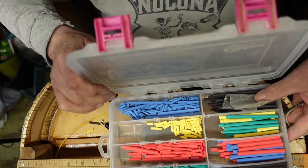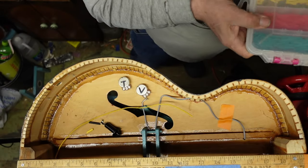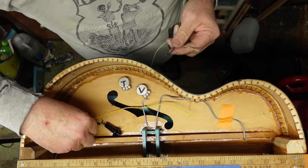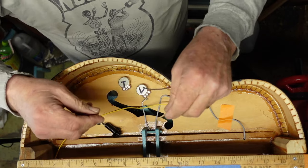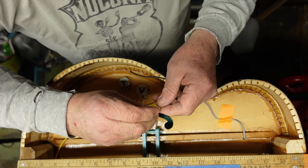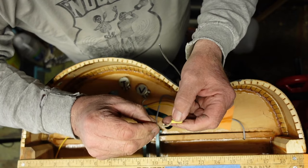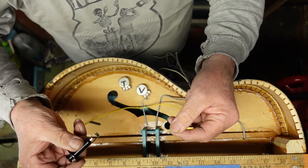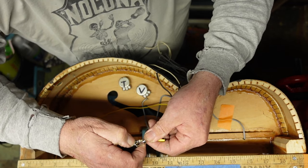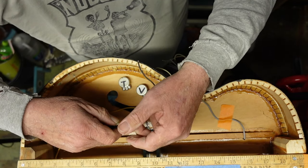So when I go, never leave that open. But when you're using your pushback wire, you just simply put one of these here, because wherever we're going to make a connection, I'm going to put a kink right there like that. And then when I solder the hot wire, which by the way goes onto the short lug of this, I might as well put this here right now, like so.